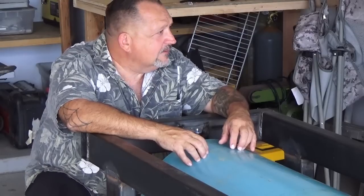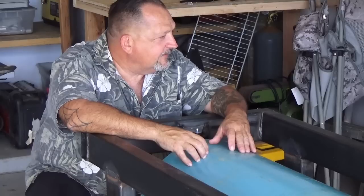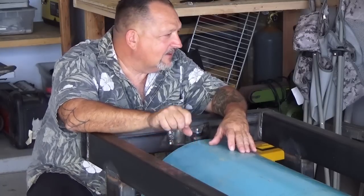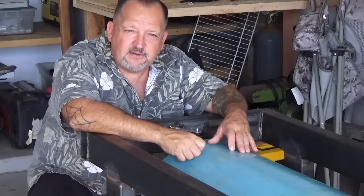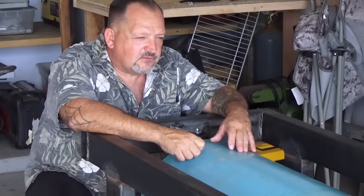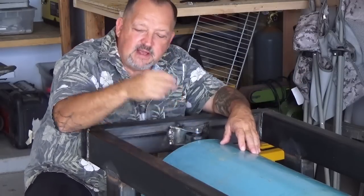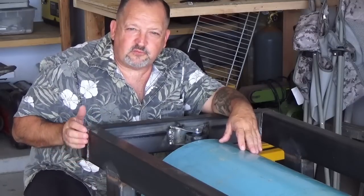My Eastwood MIG 175, I had a problem with not having my main torch wire that attaches to the gas in far enough. We weren't getting sufficient gas. There was gas leaking out there. I'm surprised I still have any in the tank, but Alec was the one that figured it out, and once we got that situated, man, those welds really smoothed out.